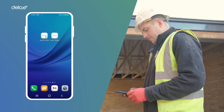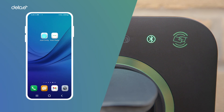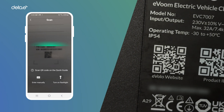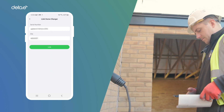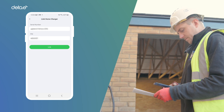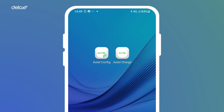If an internet connection is not available, on a new build site for example, ensure Bluetooth is enabled on your device and you have a 4G connection on your mobile phone. On the app, you'll see the Add button. Press it and scan the unique product ID QR code on the product rating label. To verify this unit, you'll need to enter a PIN number under the serial number. This is unique to the charge point and can be found on page 3 of the manual, which should always remain with the unit.